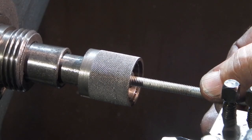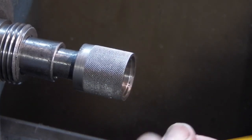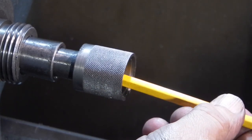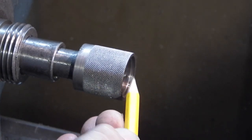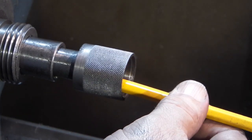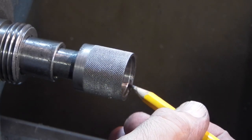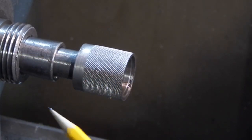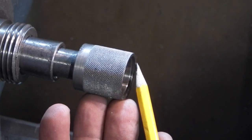At least for those that do make the same mistake, we've got a way of saving it. I've got a lip at this end, the depth of the bore is okay, the recess in the bottom of the bore is okay, it's just the bearing diameter. Because I've got a recess here, I'll bore this out without touching the back of the bore to the outside of this recess.